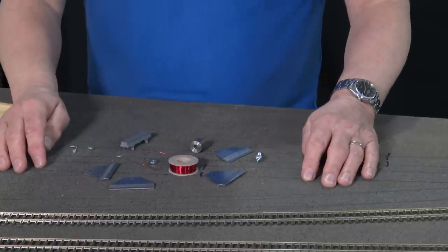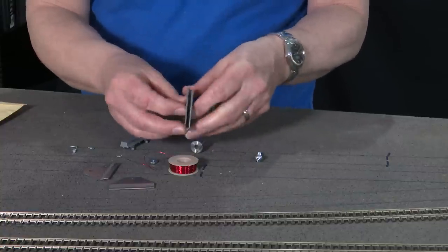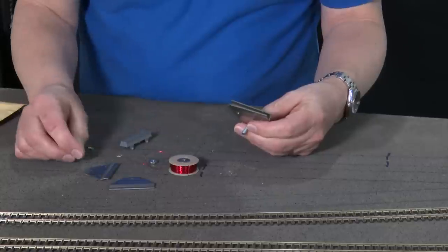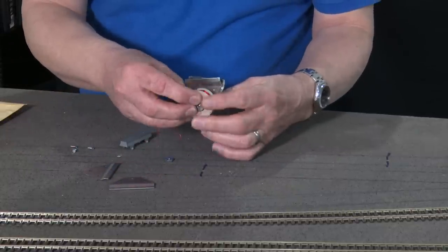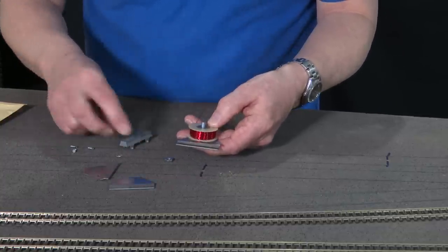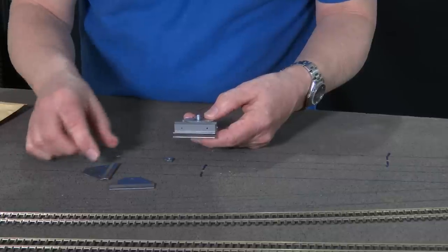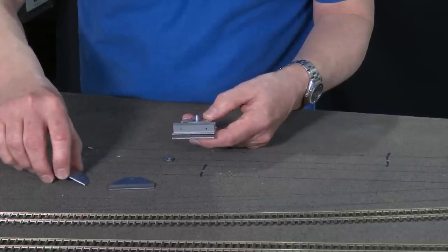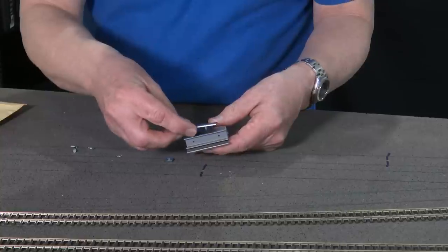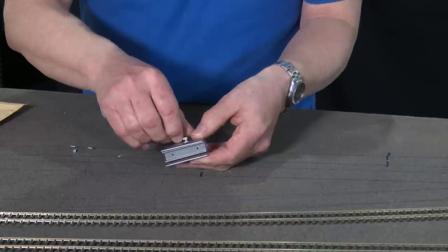These are the components we need to assemble the solenoid — there's a simple routine. You put these together leaving a small gap, then pop the bolt through, then pop the solid core into the middle of the solenoid, and then pop them both onto the bolt. There's a groove at the top of the solenoid — make a note of that. Then this little piece here has four lugs, and the lugs need to go into the holes on the plates. You fit the next plate lining up with those lugs, and finally the last plate. It should all hold in place, then pop on the nut to keep it all secure.